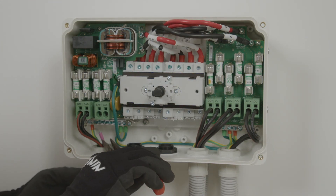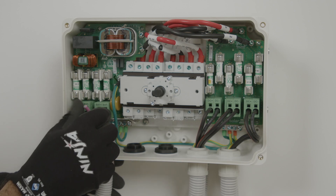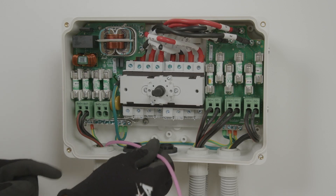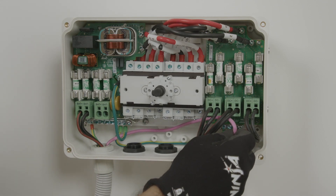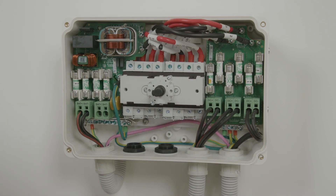The batteries will have a communications cable — that's whether it's the LG Prime or the SolarEdge Home batteries. This can be provided through the same DC conduit as the DC, which can then just loop straight through the DC combiner, back out through the connection running to the inverter. Then replace the cover, and that completes the wiring of the DC combiner.